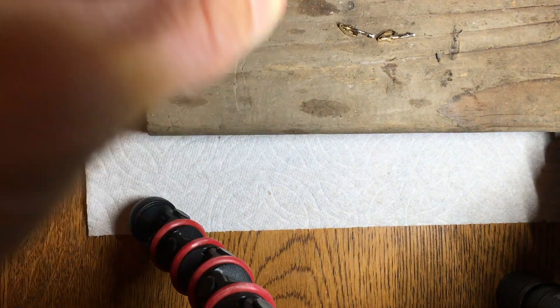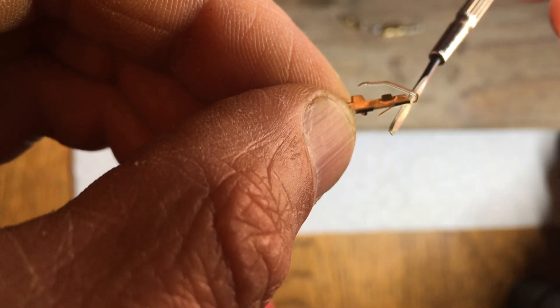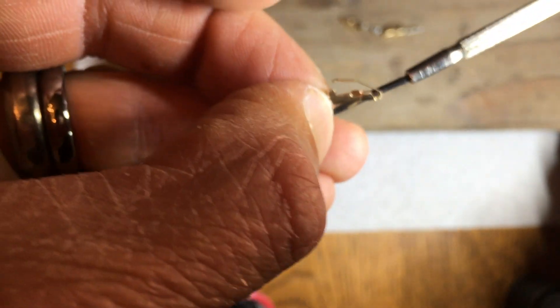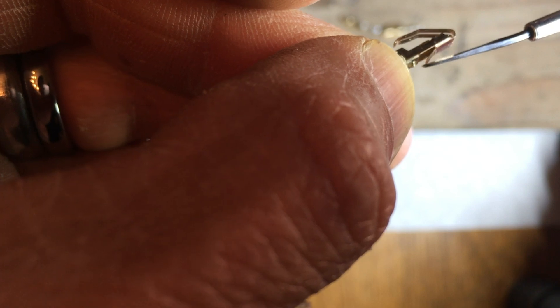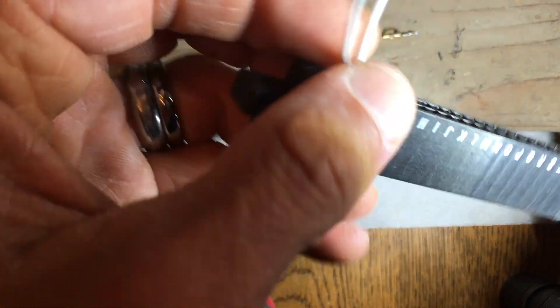What you need to do is push down this little prong right here. On the back side you can see this little tab sticking up — this is what keeps these locked in. You have to take your tool, slide it down on this side, push and deflect that tab so it gets unbent, hold it, and then pull on the wire to get it out of the connector.